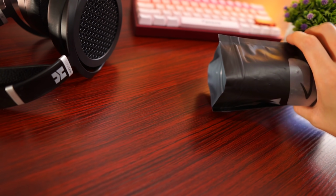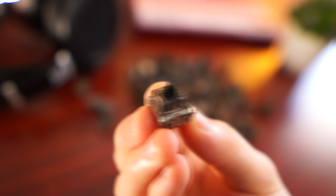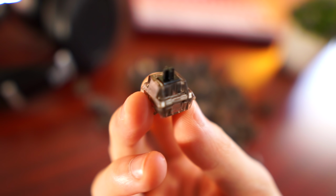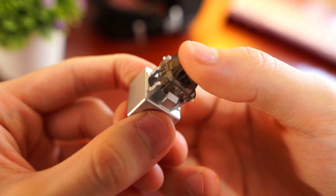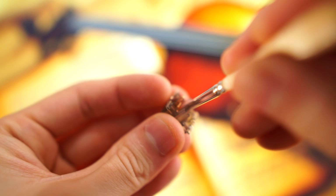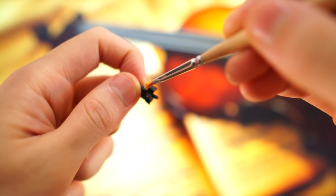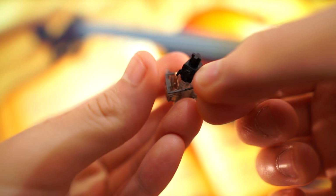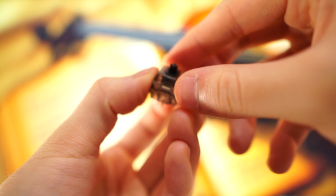The first thing I do when building a keyboard is to lube the switches, because it is the longest process. For this build I'm using Gateron Black Inks. They are pretty popular linear switches and many people have been telling me to build a keyboard with these switches. I lube them with Krytox 205g0, and 105 for the springs. Usually lubing them takes me around 2 hours or more to finish. I also filmed the switches with Deskeys films to reduce switch wobble and make them sound better.